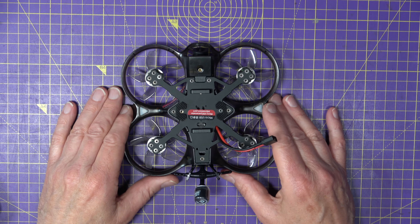Top tip number four pre-flight check, and this is one that a lot of people don't do — but if you're used to flying fixed wing, radio control helis, or anything like that, particularly big expensive scale models, you'll do all the time: do a range check. We know that fail-safe is working, we know that the quad is flying pretty good, we know it hovers okay. So just take it out and fly not too high off the ground, a distance away from you — one or two hundred meters — and just check that your radio is talking to the quad at the sort of distances that you're going to be flying. If it bombs out for some reason, maybe your aerial's disconnected or something wrong with your radio, you know the fail-safe is working. So worst case, it'll just drop out of the sky onto the grass and you're safe, and then you can check over what's going on.